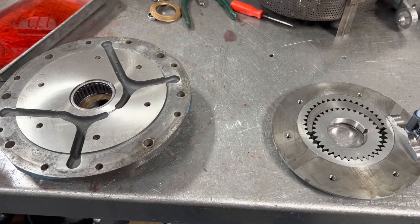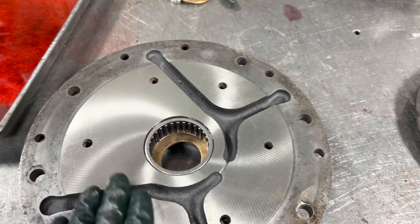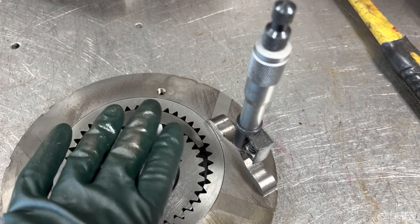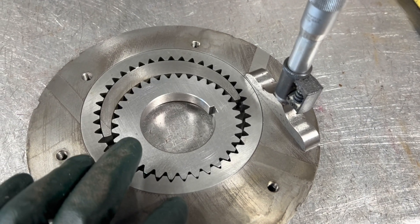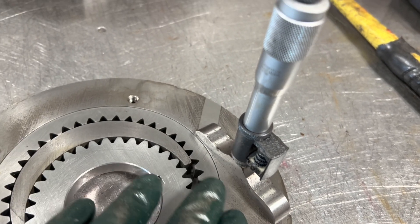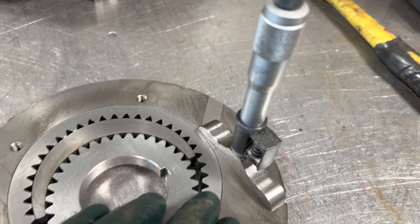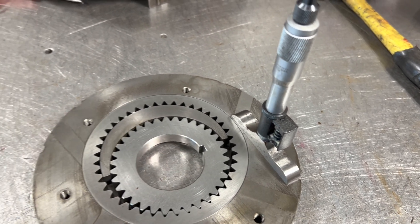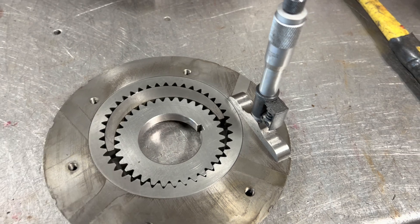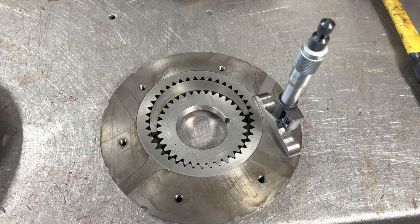Okay, I'm getting ready to build my pump here for my PV-32R. I've got my pump face all machined from where it was junk, and I sourced two new gears. What we need to do is look for about one and a half to two thousandths clearance between this plate and these two gears. I'm going to use plastigauge to verify. I used my depth mic and it looks like I've got about two thousandths - so if I zero here and drop it over to here I've got about two thousandths. We're going to plastigauge this and go from there. If not, I've got to machine this face down to get my clearance tighter. Too tight is bad, but too loose is low pressure on a gerotor-style pump.